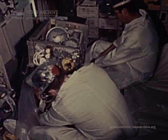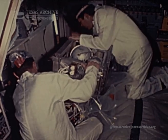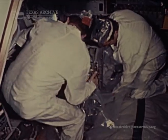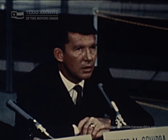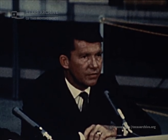We have retained the 100% oxygen environment as a basic life support system for Apollo. The spacecraft will be purged to a 5 psi level in orbit. However, we have added the capability of employing a two-gas system on the launch pad, if it should seem feasible at a later time. One of the changes in the systems is to accommodate the spacecraft to be launched with air or nitrogen, and then purged in orbit to have a pure oxygen environment — approximately 5 psi oxygen, not the 16 to 19 psi as on the launch pad. There is a tremendous difference in the flammability characteristics of materials at this lower pressure.